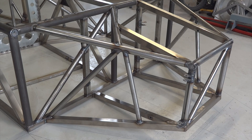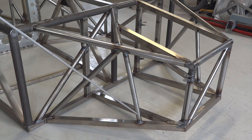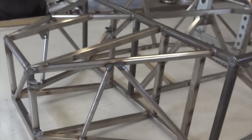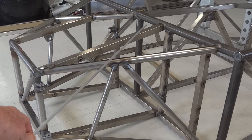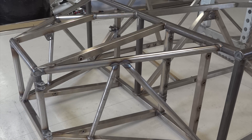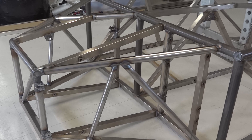Here's the back part of the chassis pretty much finished. We love triangles, but a triangle isn't enough — you actually need three of them to make a triangular prism. So there's one, two, three legs making a triangular prism to mount the rear damper, where the spring load goes in here. That makes a triangle. This one's a square, but we couldn't get right to that back corner because the drive shaft goes through there. The chassis is pretty much done apart from the spring/damper mounts front and rear, which are a bit complicated as we'll see later, and it obviously needs a roll hoop.